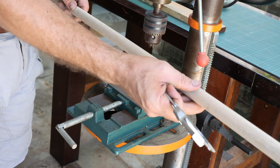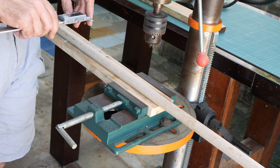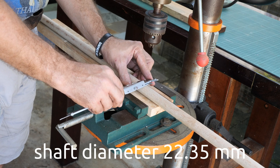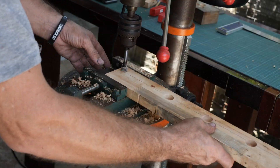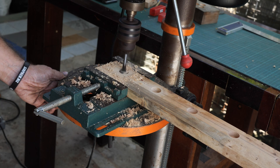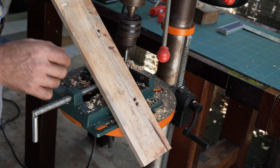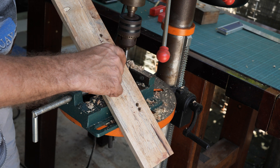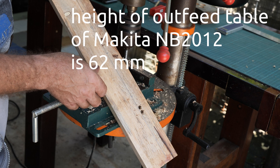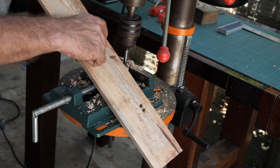So this is the piece of wood that will be supporting the rolling PVC pipe. Let's measure the diameter — 22.3 mm. Let me explain the measurements. The outfeed table of the Makita thickness planer NB2012 is 62 mm, so we want the top of the roller to be exactly 62 mm.